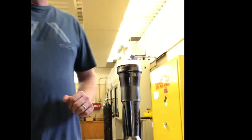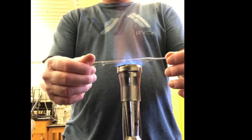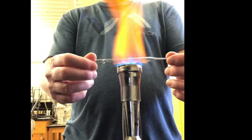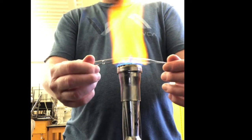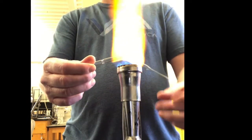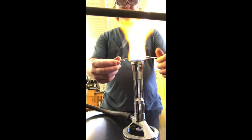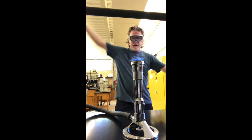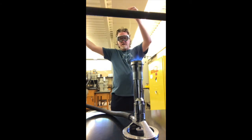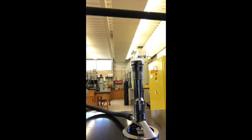I'm going to pull another capillary tube with a better camera angle. I'm heating up the pipette in the blue jagged flame on the bottom, twisting it a little so it heats evenly. Now it's bendy - once it's really bendy, the key to getting a good pull is to pull while it's still in the flame but step back at the same time. That gives you a nice long thin capillary tube. The middle is cool already but the outer parts are very hot, so I'll set it down on the counter to cool.